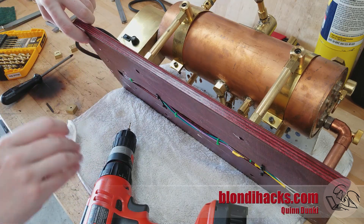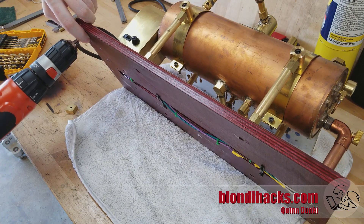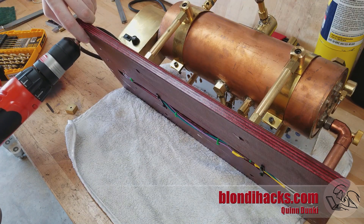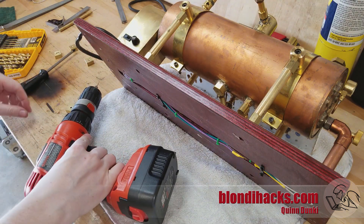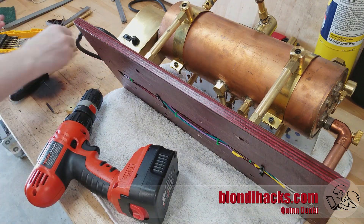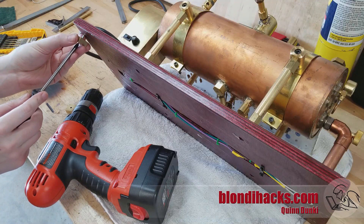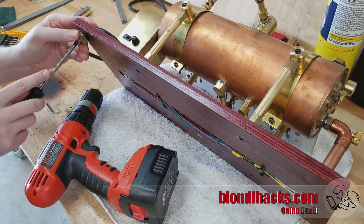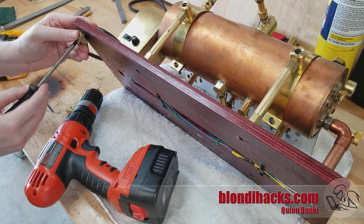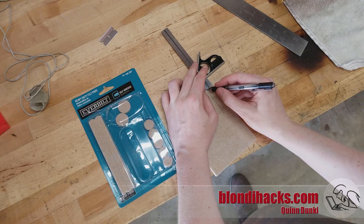Now we're ready to mount the feet on the base. I'm using another foot as a spacer on the top and the side just to get it perfect. I've got the drill bit choked up so that I can't go too deep — choked up to the perfect depth to go through the foot and then the right amount into the base. So I just drill through the foot and it's in the perfect place, then screw that foot in by hand. This is also a really good look at the channel cut underneath the base for that wiring — it's 120 volts, going from the thermal switch to the electrical box at the other end. It's secure under there, but you can see how I would want to keep that up out of the water.